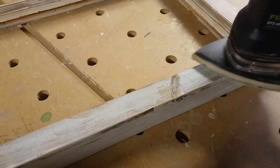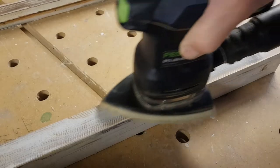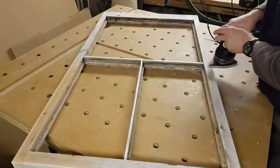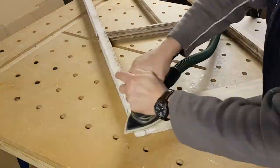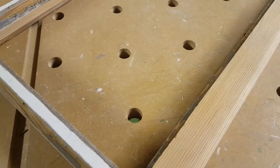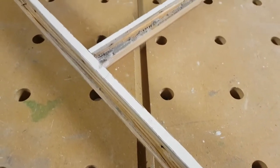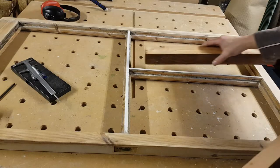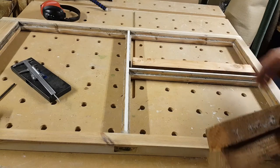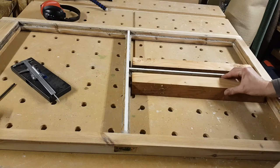Once that's all done, give the frame a quick sand down and take it right back to bare wood. There are a few fissures and cracks that need filling but there's no rotting wood so there's no major concern. Next, prepare the frame for routing. The pieces of wood will go through a thicknesser to make sure they are exactly the same thickness as the actual frame itself.